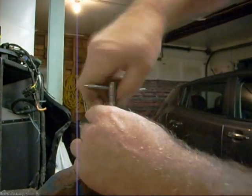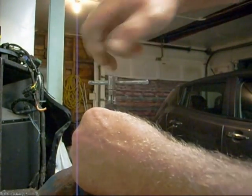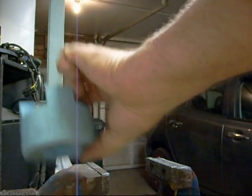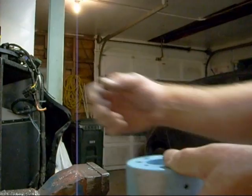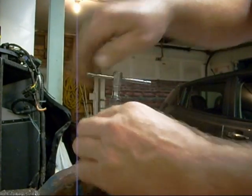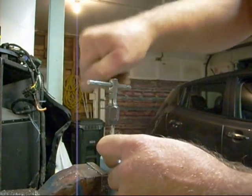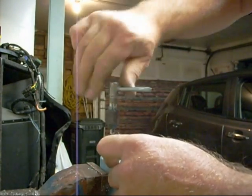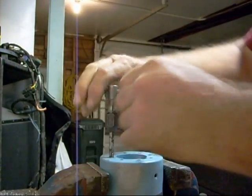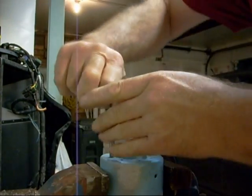You can't get all the way to the bottom of the hole because each time you cut a piece of thread, a piece will drop down to the bottom and it builds up. So you've got to take the tap out and empty the hole — you don't want that getting bound up in there. You can also use cutting fluid, though it seems to be quicker not to use it, especially when doing it by hand since there's not that much heat and friction generated.